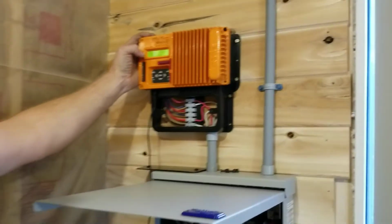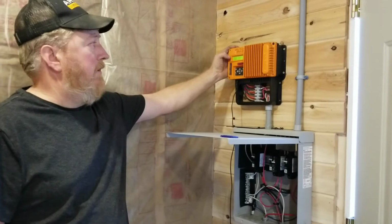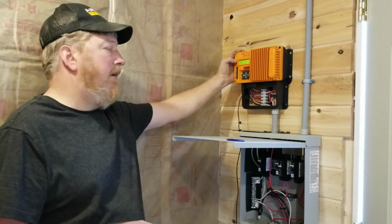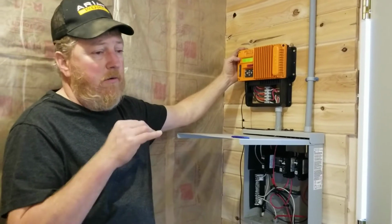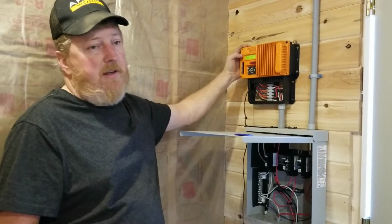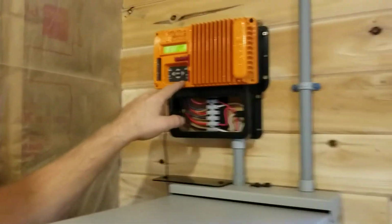Unless you've gone from an older firmware to a pretty modern firmware, the KID doesn't need to do a factory restore, but I really like to do that anyways, just because anytime you update firmware in a device, I think it's a good idea to do a factory restore, fresh reset, and just go from there. So we're going to now come in, and I'm going to show you how to do that manually.